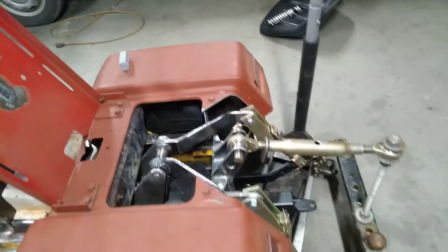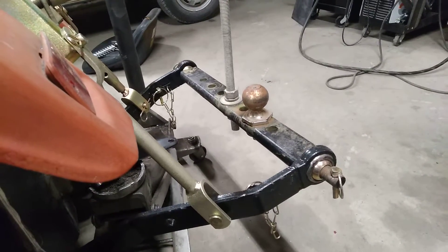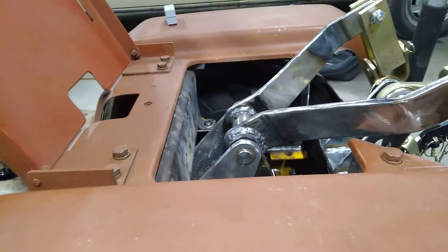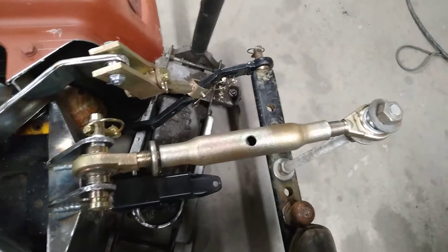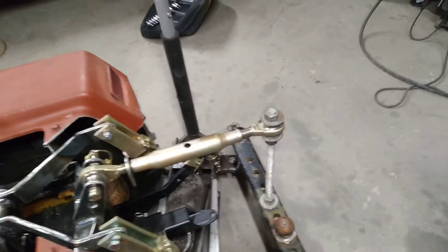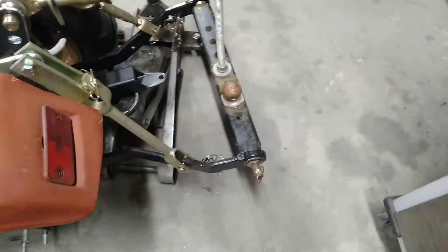It's not quite as low as it can go because I've got a jack in the way, but I'll show you how fast it goes. I've got all my switches over here — this is my up-down switch. It goes up there pretty good. It stops internally — there are limit switches inside the actuator, and it's strong too; it can easily pick me up, no problem. On the way down I'm having to push with my foot because this top link is very stiff and provides quite a lot of resistance against the toe bar going down.